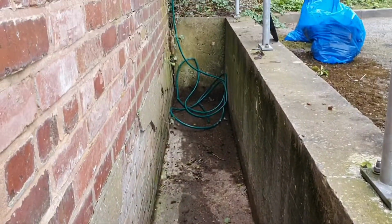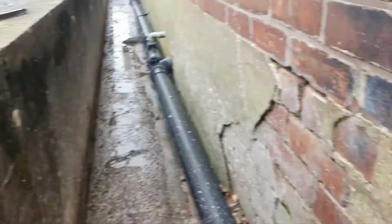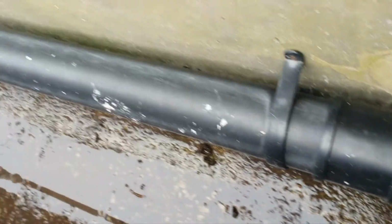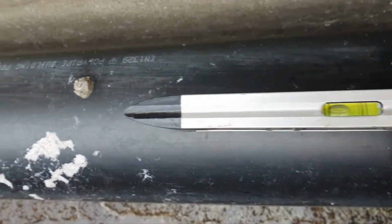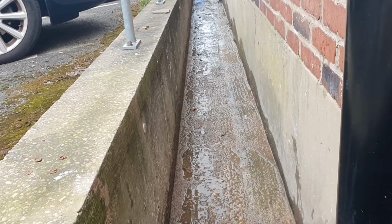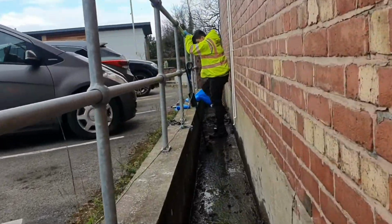I'm back in this culvert as promised. We're going through cleaning this out now. I've done a CCTV through this access point. All clear. I've checked the falls on this run, it's fallen. It's falling. So, Mark's just brushed right through. We're getting the worst up into the bags.